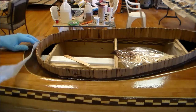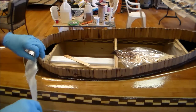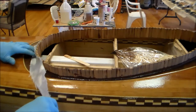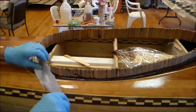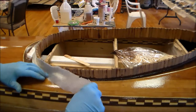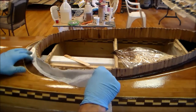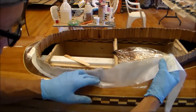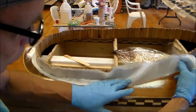This glass was cut on a bias. To cut on a bias means to cut on a diagonal to the weave of the fabric — typically 45 degrees — so it'll make the curve. The fabric will now bend easily at that 90-degree junction of the deck and the hull. The fibers in the fabric are running at a diagonal and not up and down.